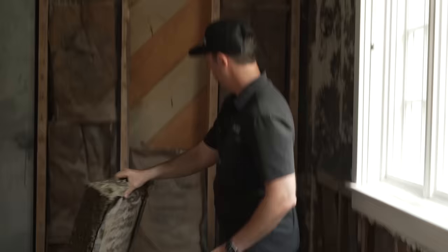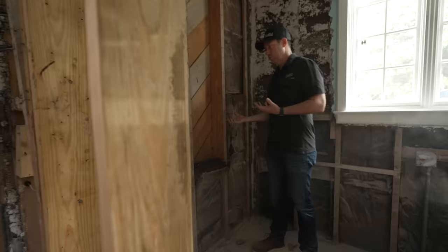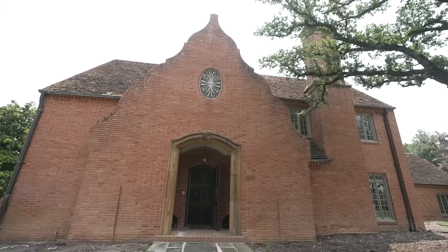If we take these batts out, it looks like they resheathed this area with some solid sheathing. What's interesting is that again there's no rot, there's no mold. Why is that? In a modern building with no overhangs, brick cladding, and some particle board sheathing, we would see some serious problems — especially because there are lots of holes in that sheathing and lots of airflow.